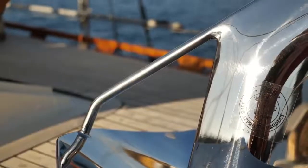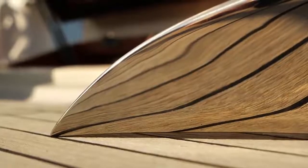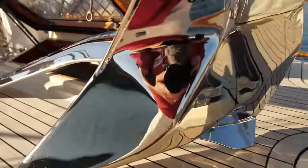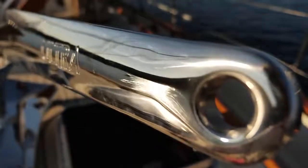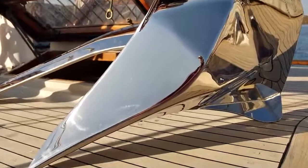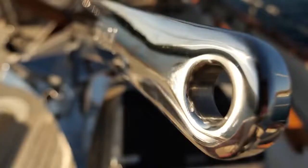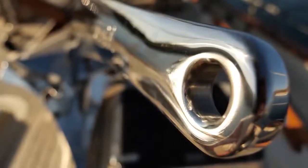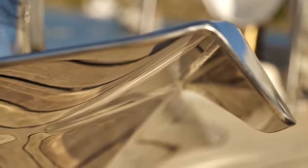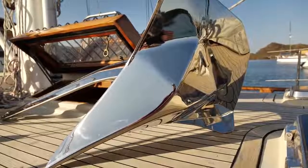The Ultra's build quality really speaks for itself, and there are some super design features: a bar from the shank to the heel of the anchor ensures the chain won't wrap around it and trip it up; a super sharp tip that curves down so it's always the point of contact with the seabed; no roll bar to pull the balance backwards; a hollow shank for lightness; and similar to the Spade, a lead tip — all making sure the weight is as far forward as possible. There are little wings on the bottom to keep the anchor down as it turns on a wind or tide shift. The underside is contoured so that when weighing anchor with the rode straight up, the anchor will pivot for an easier release from the seabed.